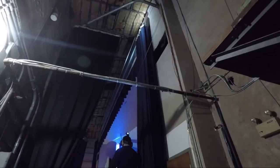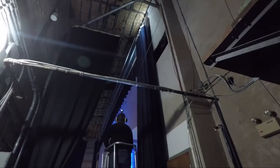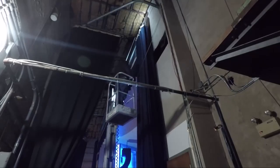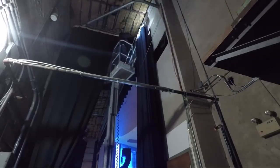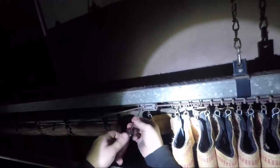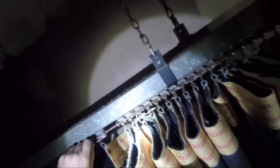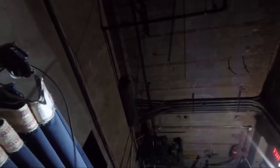The system is operated with a cable that's spooled onto and off of a big drum. In the opening scene there you saw the mechanical timer that operates everything. The cable had started to fray — it's a steel cable about 1/16th of an inch, pretty high strength with a cloth sheath over it, and that sheath was fraying off and then jamming the system up.